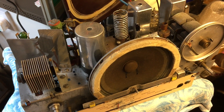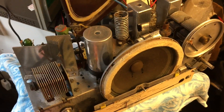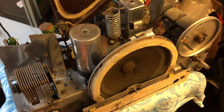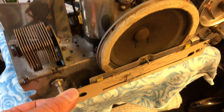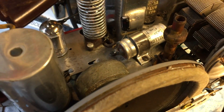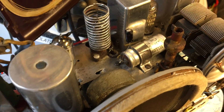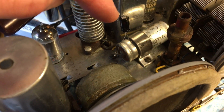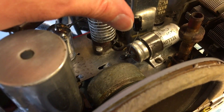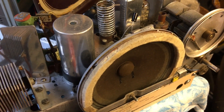I'm finally getting to the bottom of this radio's flatulence issues. Before, whenever you turned it off it let one off. It's not doing it anymore. What it was, was this capacitor here — one of them is the cathode bypass cap. It's not open circuit but it's not very good. I've bridged it with that for a minute, and if I take that off, all of a sudden we've got instability issues and flatulence.